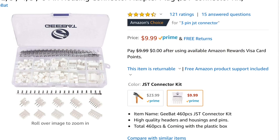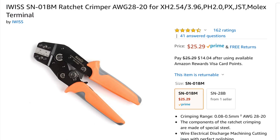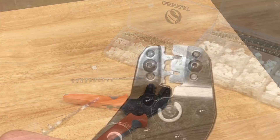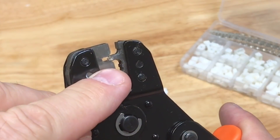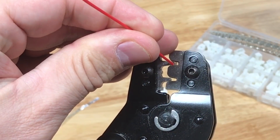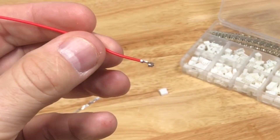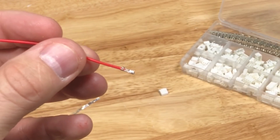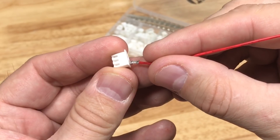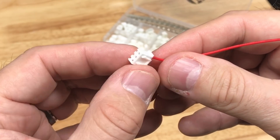I'm going to make my own harness with this connector set and a crimper tool I've used in previous videos. You take the metal pin, put it in the crimper, get it pushed in partially, then bring in the wire — not stripped, just insulation and wire all together. Put it inside the crimper, squeeze it, and the crimper will roll the pin and cut through the insulation to make a really good connection. Then the locking pin goes into the slot and snaps right in place. I just need to make a second wire for the other side and this connector is ready to go.